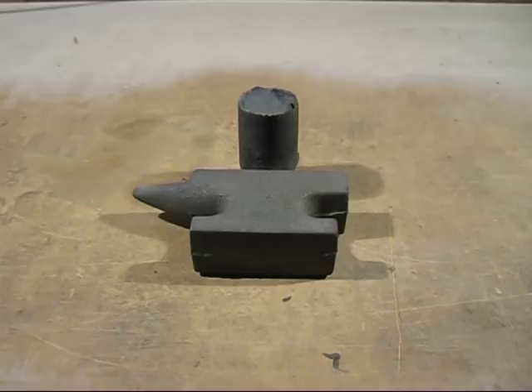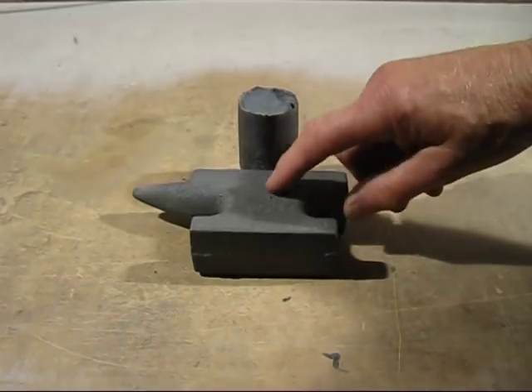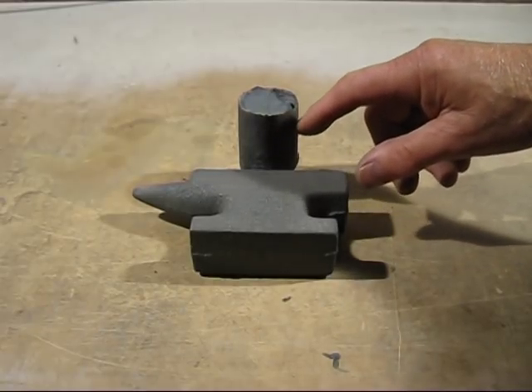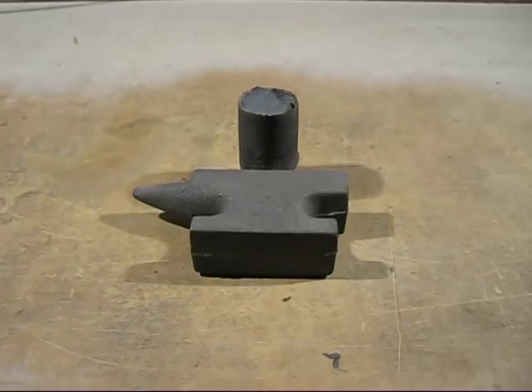For the sewing machine scrap, if you're going to use it, it's great for thin castings because it's very soft and fine-grain cast iron. So if you're going to make steam engines or internal combustion engines, it's probably the best material for that. But if you're going to make thick castings like this, it's probably a waste and you'll need larger risers to feed the shrinkage.